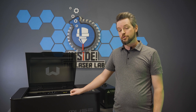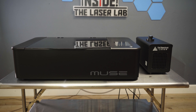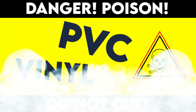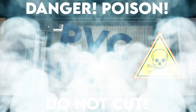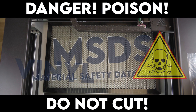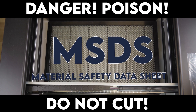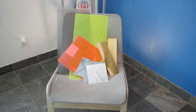Now that your MUSE is set up and you're ready to go, there are a few things you want to keep in mind. Before you begin, make sure you know what your materials are made of. You don't want to cut any PVC or vinyl under any circumstances. These materials, along with others, produce chlorine gas when used in your laser — a very toxic vapor that is lethal to humans and highly corrosive to your MUSE. If you don't know what your materials are made of, consult the manufacturer or seller to get the Material Safety Data Sheet, or MSDS, to see if it is safe to use and doesn't produce any toxic vapors. If you aren't able to get the MSDS, it would probably be best to move on to something else. It's not worth the risk.